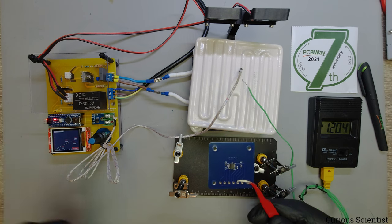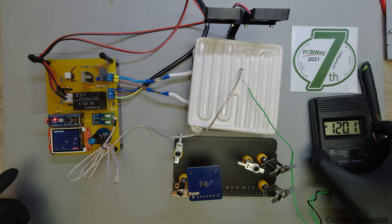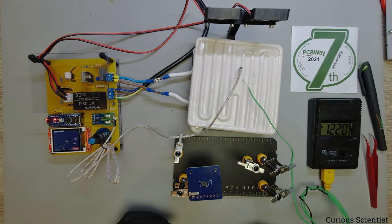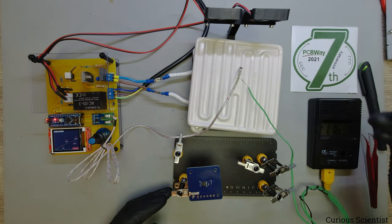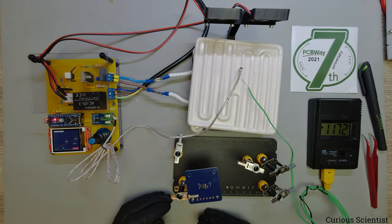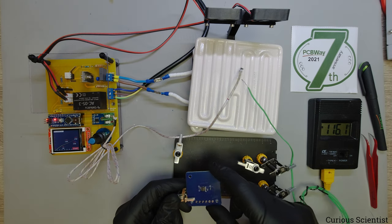The temperature was followed relatively nicely, so that's quite nice, and the soldering was done in a good way. You can still see on these two displays that this thing is still at 124°C or 120°C - hot for touching and working with. That's the drawback of this kind of heater: it's a big piece of ceramic tile and ceramic is not a good thermal conductor, so once heated up it takes some time to pull out the heat. But overall this was a successful experiment.